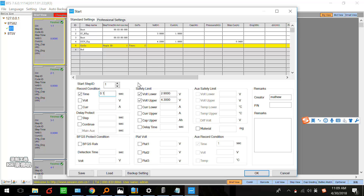Here the voltage lower — just a little lower than the discharge cutoff voltage you set. Here I would like to set 2.9. And the voltage upper — just a little higher than the charge voltage you set, a little higher. And this is the current safety limit. And capacity upper.